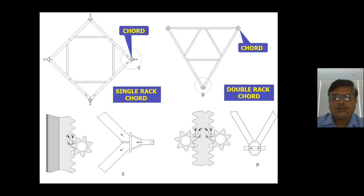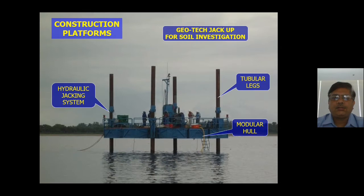These are various sections of the TKY connections mentioned earlier. The rack and pinion system works with teeth precisely aligned to give accurate jack-up and jack-down movement. The operation is also very noisy because mechanical gears are involved and there is enormous weight being moved — so significant noise is generated during jacking operations.